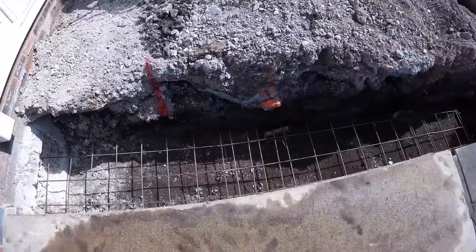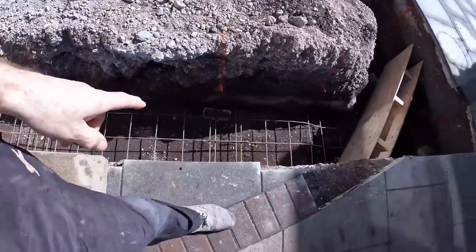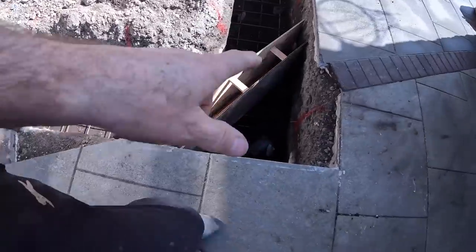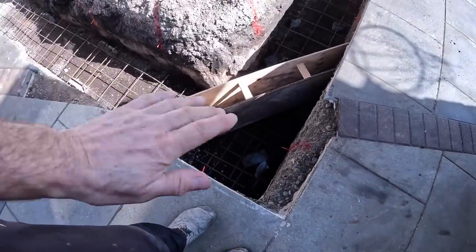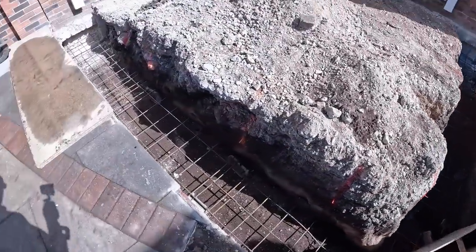So I'm gonna get my rake out, get my tamp out, and get ready, set this camera up, ready for getting this concrete poured in. So I'll see you around there. We've just had a bit of a rain shower, but it's passed over. So all our steel is set up, all cable tied together. It drops down under there, so the concrete continues, but the concrete's coming up to that nail. So let's get this camera set up ready for these lads.